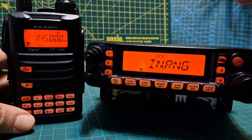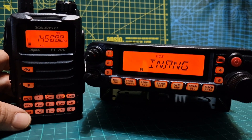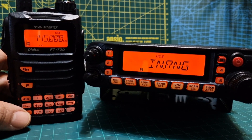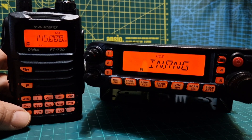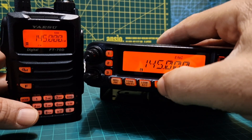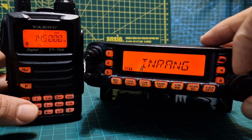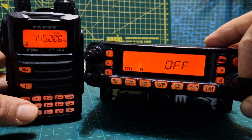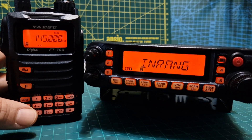As long as I can reach the other station with the same DCS number it's going to say 'in range'. If it doesn't get a reply — because both radios talk to each other when both are on ARTS — in a minute this is going to say 'out of range'. There are beep settings: hold down set, then number 2 is beep, and you've got 'in range', 'always', or you can turn it off.